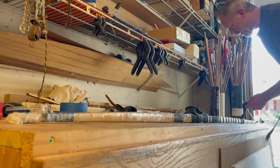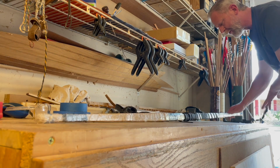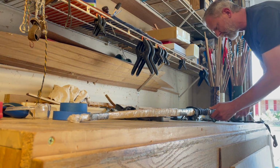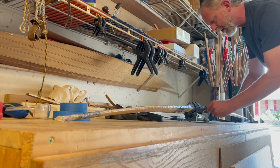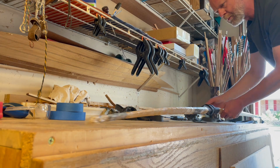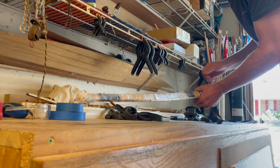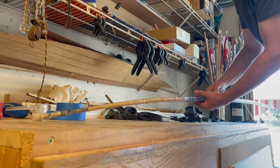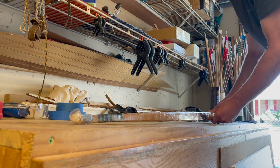I had not changed up my tools in any way between the last glue up and this one. So I have essentially remade the same bow in between the two lams, one of which has already been modified, that being the belly, to accomplish the tiller that we were at prior to the break. And that is to help ensure that the tillering job that I've done up to this point might actually carry over into this finished bow, which, if everything were to play out perfectly, and that is expecting an awful lot, this bow should already be tillered to 28 inches. Poundage to be the question mark, and that's the intent.